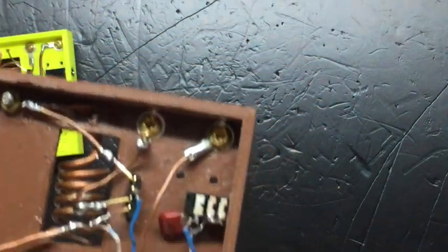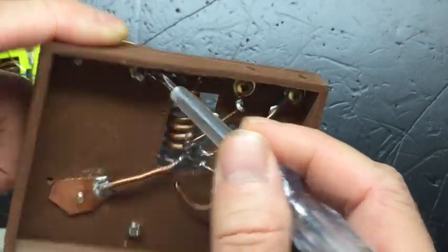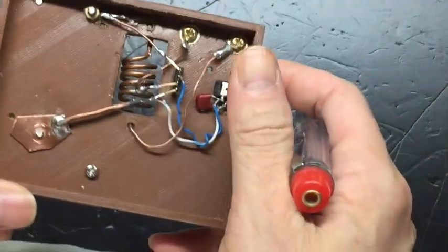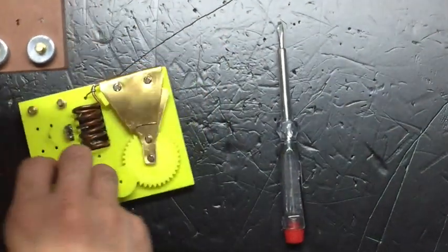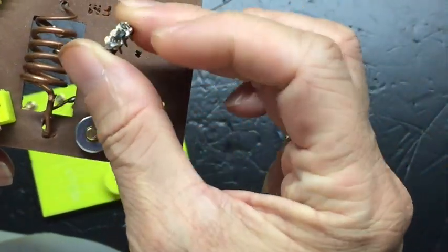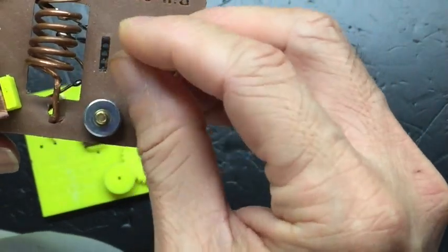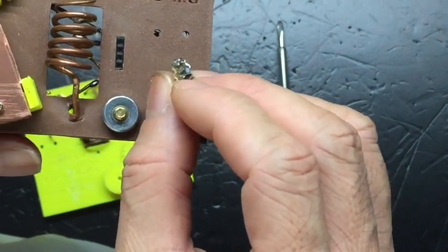And then the last leg of the MOSFET socket, we connect to the fixed plate to here, right, which is also connected to the hot end of the coil. Okay, so that's all the wiring. So when you use this with a MOSFET, the MOSFET has 4 terminals, so it's a surface mounted component. I usually mount it into this 4-pin Arduino type socket. The middle 2 pins I connect to the drain and source of the MOSFET, D and S.